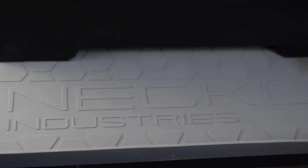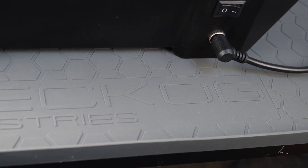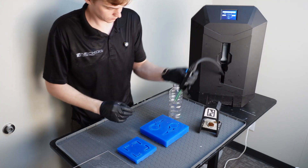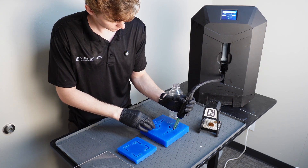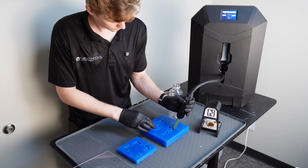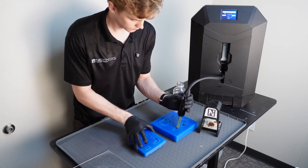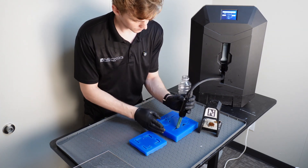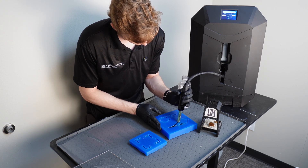We already have a video on our channel showing how to make your own silicone molds, so I'll get right into injection. We've had many requests to see an application for flexible material. I made these molds for furniture corner protectors and door stops. Using our variable speed function I've turned down the flow rate to ensure perfect injection. With thinner parts it's important to err on the side of caution by injecting slower so as to avoid bubbles accidentally catching on the walls of the mold.